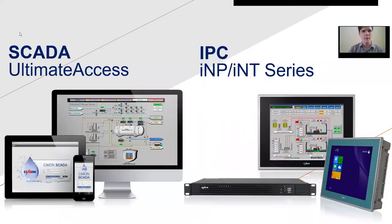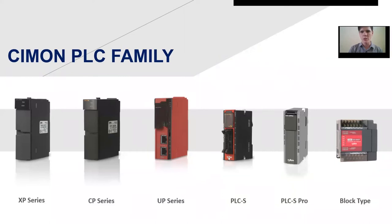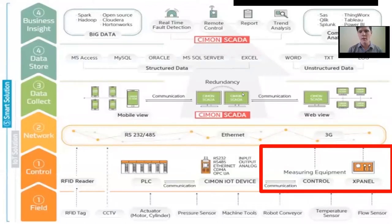Let's get back to the presentation. Next in line, we have some other products. We have a SCADA product called Ultimate Access — more of a controlling point software. We also give out IPCs, and that can come already attached with a SCADA. This is our PLC family lineup, just to let you know that we also do have PLCs as a distribution. And then here's an overall layout of a factory line networking — this is where your X panel would come into play. It retrieves data as a client from a server, getting communication from sensors or switches. It communicates directly with the PLC if needed, and it can also act as a server, with the SCADA pulling data from the X panel. So it can be a server and a client all in one.